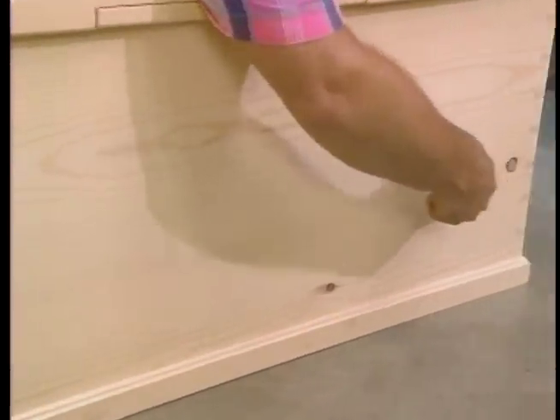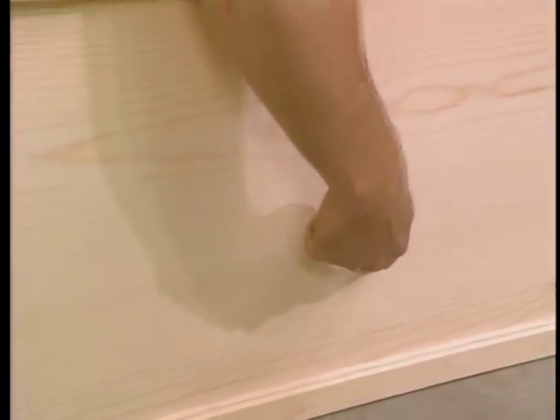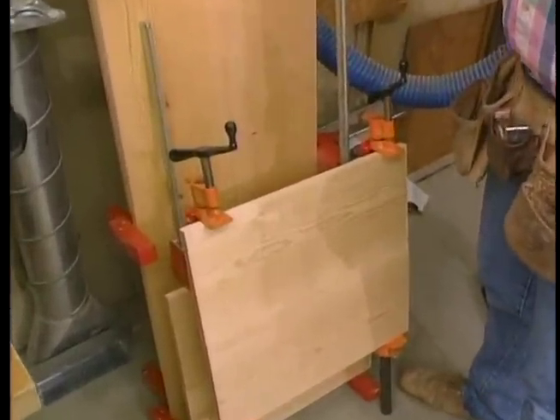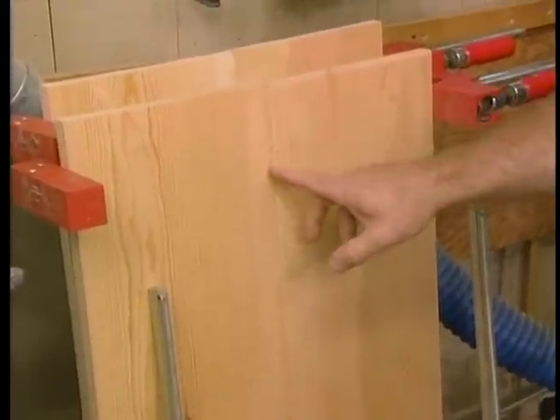What I had to do is glue boards up. In fact, there's a joint right about here. I took the trouble to match the grain as closely as possible. To accomplish that, I find that if I cut all the pieces from the same length, they match pretty closely. So one 12-foot board was enough to do the front and one end. Here are the four blanks for the sides of the chest. With today's modern glues and good clamps, that's sufficient for this joint.